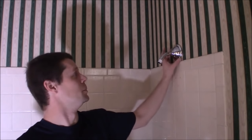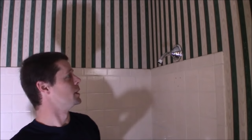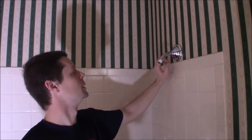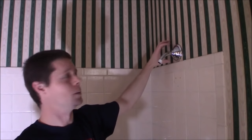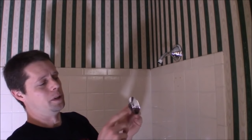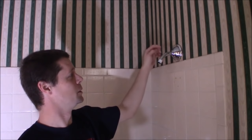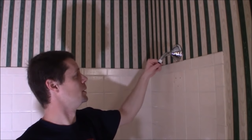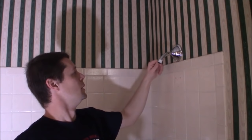Things never go exactly as planned. This was the original beauty ring cover, and I knew it wasn't deep enough or big enough around. I had picked up this larger one that's really meant to fit around a drain pipe - no problem with it, but the inner diameter of the hole is way too big. So I had planned to stack it on top, but what I didn't account for was my bead of epoxy was too thick for this to sit flush. What I ended up doing was picking up a different style - basically the same thing but a little deeper. It's still not big enough diameter on its own to cover, but unlike the other one it doesn't have a set screw - it's a friction fit. So I just left it. Behind there is the epoxy - I let it set up overnight even though it's a one hour set time. It's really pretty stout.